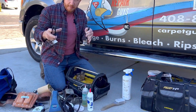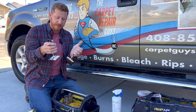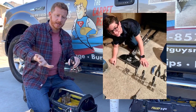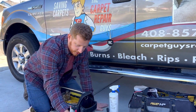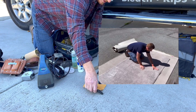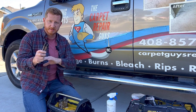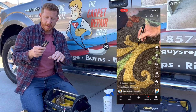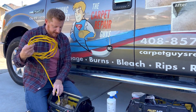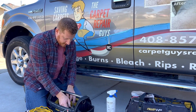Seam clamps. The bigger the patch, the more you want to allow a little bit of a gap so that you can actually stretch the carpet. Carpet's made to be stretched, otherwise your patch area can get a little wavy. This is a piece of paper that I'll use over a patch piece and roll to see the direction that the tuft is going. Here are some little markers — especially with a frieze carpet that's multi-colored and speckled from a closet — I'll mark up and try to manipulate.